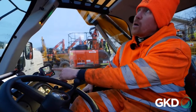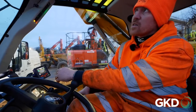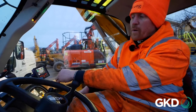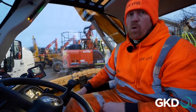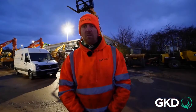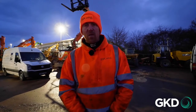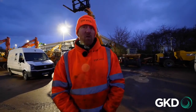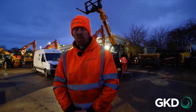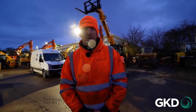Watch as she's coming up. Before we've got to the limit, she's got to a point where we're getting close, so she functionally cuts. She's then going to allow us to go a little bit more as we come up to our window. There's a 500mm window from where you're set, so you can't overachieve if you're travelling at speed. The idea of the system is to make it as easy as possible to have a height limiting system on the machine without interrupting its use. Really easy to power the machine up and down, and functionally add and remove limits and work within a preset environment — so there's no danger to infrastructure, other machines, or human life.